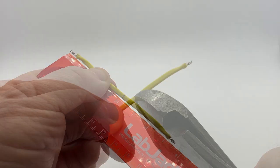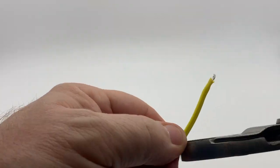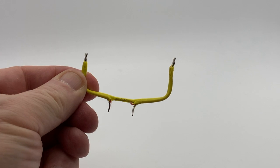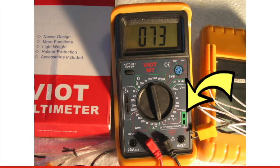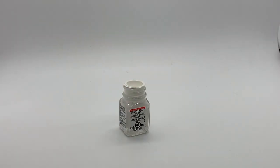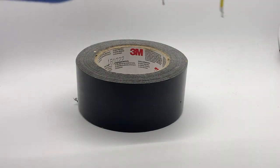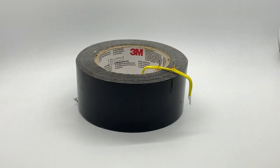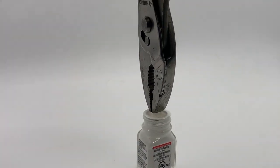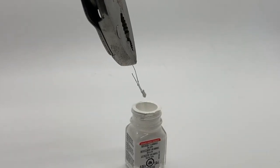To create the sensor, cut off a 3-inch strip of thermocouple wire. Remove the outer jacket from both ends, then strip one-quarter inch of insulation from the wires and tightly twist them together to create two thermocouple junctions. Find the center point and carefully cut through one of the thermocouple wires, leaving the other wire untouched. Strip away the outer jacket at the center and strip the exposed ends — these are the leads that you'll connect to your voltmeter or data acquisition system. You'll need to electrically isolate the two junctions from the metal spheres by dipping them in enamel nail polish or latex-based paint.